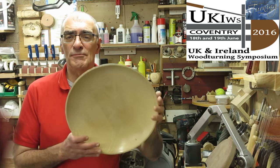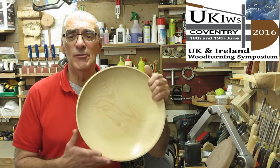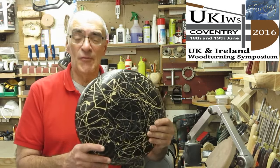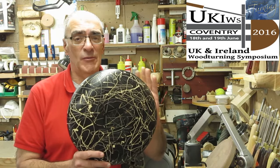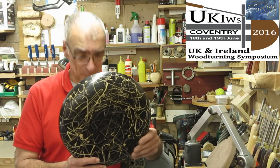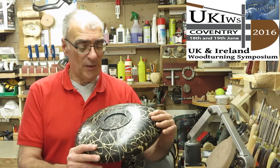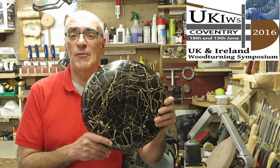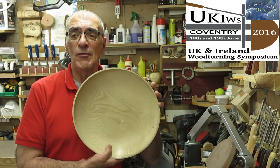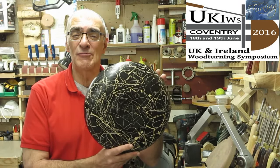Let that harden up a little bit and then I'll give it a final buffing, one more coat, and then we'll be done. I've left the inside plain — a couple of coats of Wood Wax 22. And that's the back again with a couple of coats of Wood Wax 22. In fairness, the ebonising spray should be allowed 24 hours to cure, but I haven't left it that long — just to be sure you don't get any lift off. I hope you found it interesting and it gives you some ideas to experiment and inspire you to have a go. I think it's a great method and I will be experimenting with colour later on and different colours. Well, I hope you've enjoyed today's video — thanks very much for watching, don't forget to subscribe, and I'll see you very soon. Cheers now.